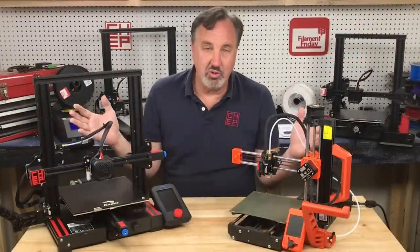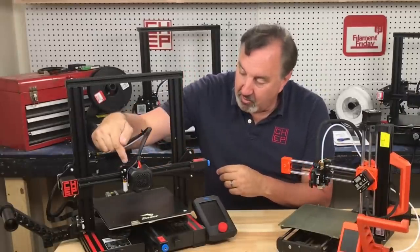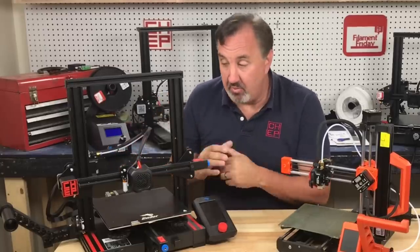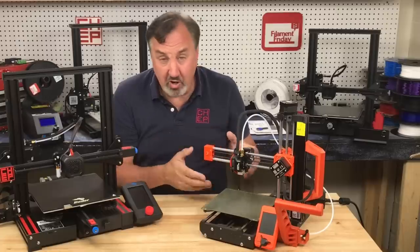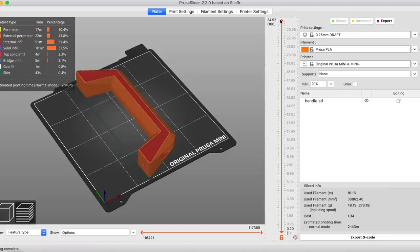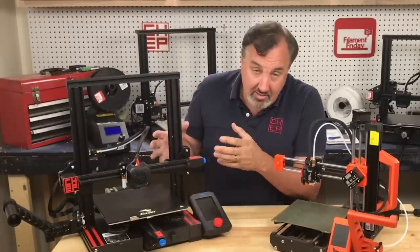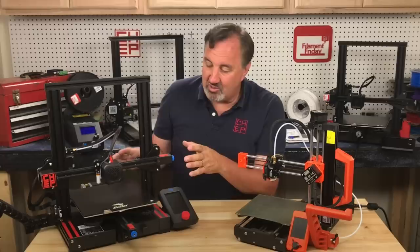Now people will ask which one they should buy — well it really depends on what you want. You've seen the Ender 3 on my channel many times: how to upgrade it, how to fix it, how to put BL-Touch on it with third-party firmware because the Creality firmware is terrible, and how to use my Cura profiles to get good prints. I got it printing beautifully for $300, but I did a lot of the work. The Prusa Mini Plus — adjusting for the auto level sensor is all done through the LCD, it's very well done, and the Prusa Slicer is designed to work with it right out of the box without loading special profiles. So this is really more of a complete setup for someone just getting started, while the Ender 3 is for someone who wants to tweak and play with it and save some money.